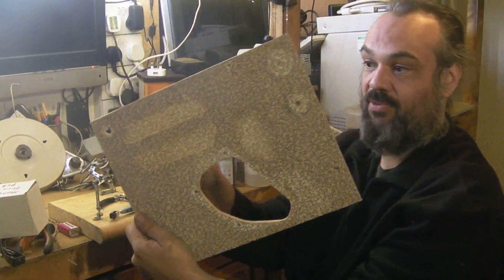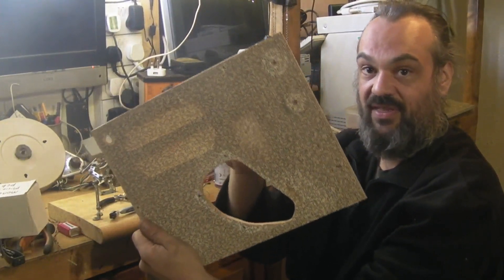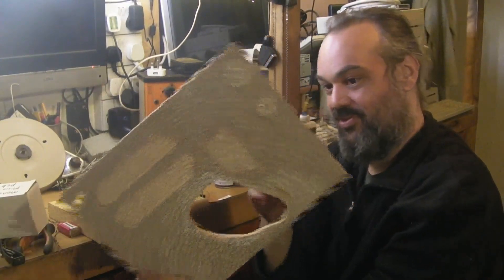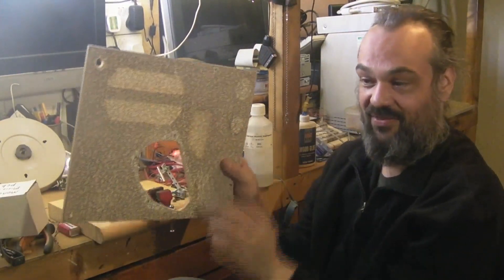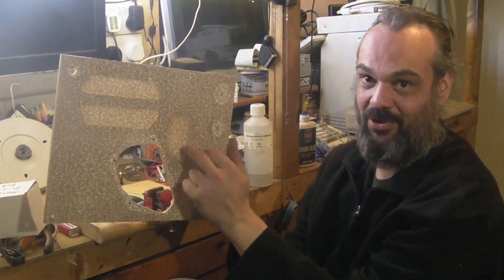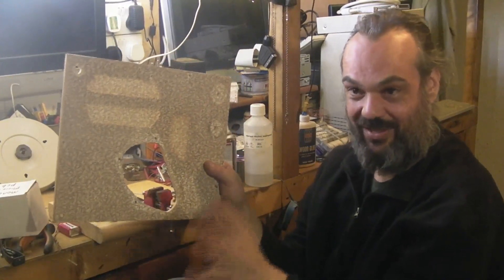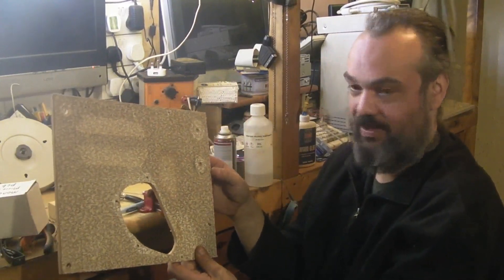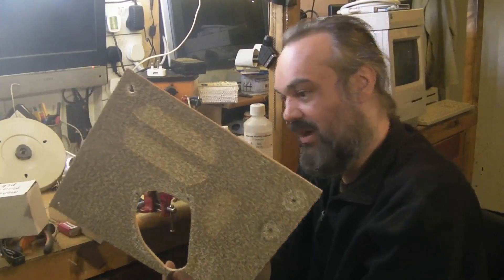You can see on the camera there where the speaker is. That little gap you can see is actually where the heat from the valves is meant to escape. On quite a lot of these record players you can see some discolouration — I've even seen one where it had been so hot it actually burnt a hole through there. That's why we're looking to make this one a little bit on the safer side, as well as being rather more powerful.